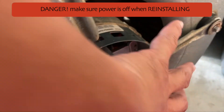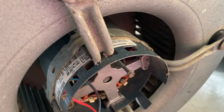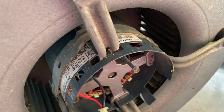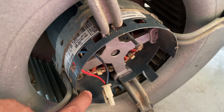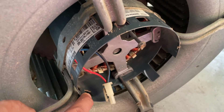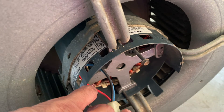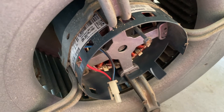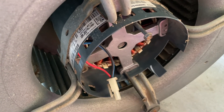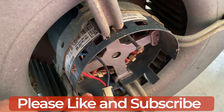When you have ECM issues and want to know if your ECM is bad, the symptoms are basically either your fan is blowing at full speed and not slowing down, or it's running constantly - when you turn your AC off from the thermostat the fan blower keeps running. Those are signs of a bad ECM controller. Another sign is the fan is working very slow, not pushing enough air, causing icing on your air handler. Or it's completely not working - you open it up and your fan is not working at all or working very slow.